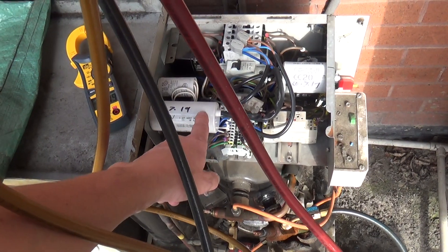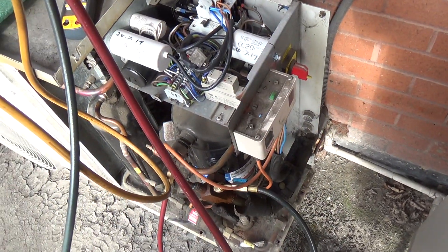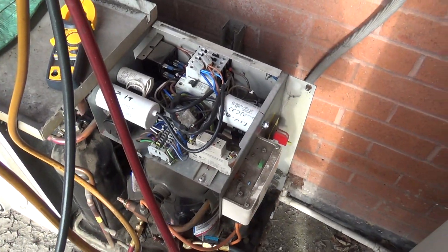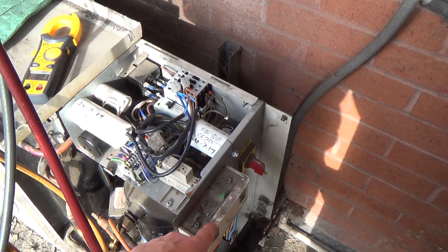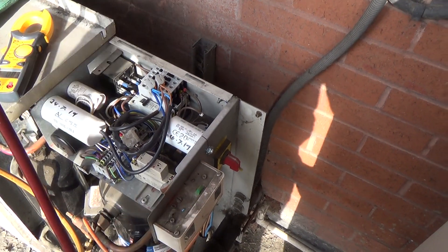The run caps were out of spec and the condenser was dirty. So it must have just been chattering away. But luckily I've got one on the van, so we'll get that swapped out. That's something to be aware of with these — I've seen quite a few of these manual reset ones where they don't trip; they just fuzz away right on that point when they should trip. The auto ones can do it as well.